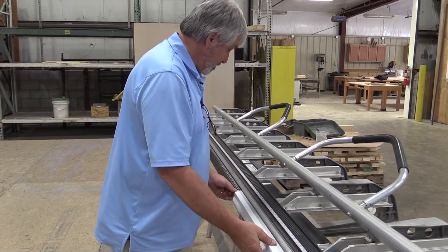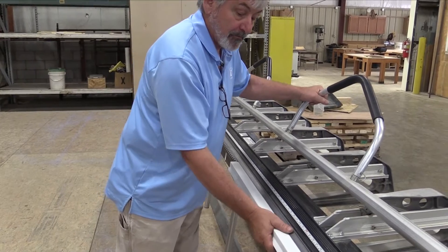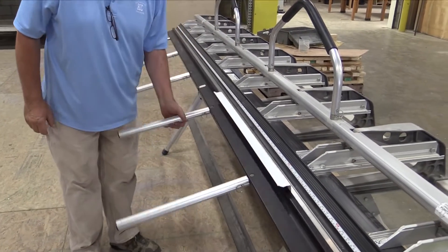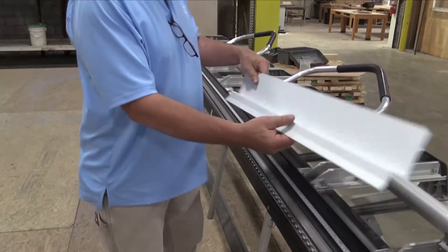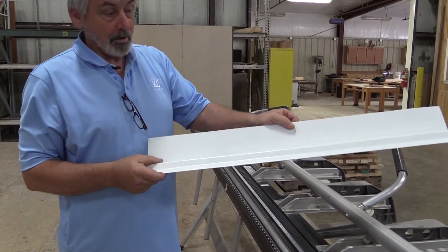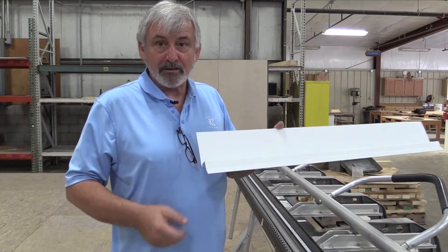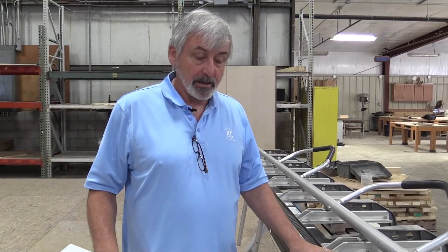My last bend is going to put that final flange on it — get it lined up, lock it into position, and bring a 90 degree bend. And there is our flashing to set on top of our doors on our houses. We'd have to custom fit it and bend and fit it there. But that's how we operate a brake.